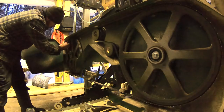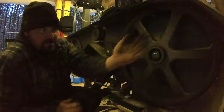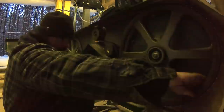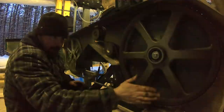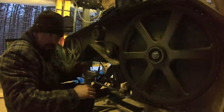I'm making sure the blade is where it should be between the blade guides and lined up on the band wheels. I'm reaching my hand behind the band wheel to feel whether the back of the blade is flush with the back of the band wheel — on both band wheels. Once I'm happy with the position, I tension the blade up to spec, rotate it once, and check alignment. If the blade drifts forward or backward, I loosen the tension and make the tracking adjustment on the back.